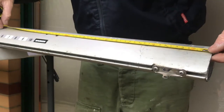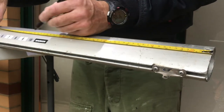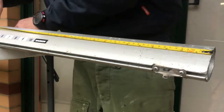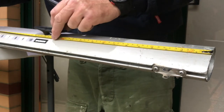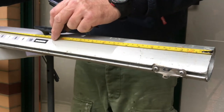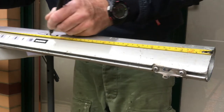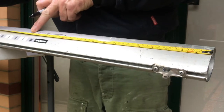The optimum position for the mast spanner is about 14 and a half inches from the bottom of the mast. I'm going to go a little bit higher anyway, just so I'm not in the way of this horn — I actually want to put that horn back on there. So anywhere above the horn is good for me, somewhere around 15 and a half to 16 inches should be okay.